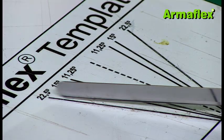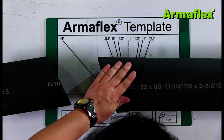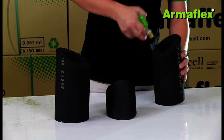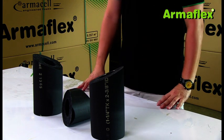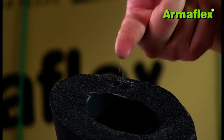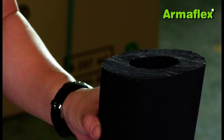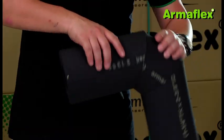For this work, the ArmaFlex tube is cut at a 22.5 degree angle. Both three-piece and four-piece elbows should be assembled in the same way, using ArmaFlex adhesive. The adhesive should be applied to both edges of the joint, and the pieces should be left until the adhesive is tack-dry. The adhesive's initial drying time may be determined by the fingernail test: touch the surface with a fingernail. If the fingernail does not adhere to the surface and the surface itself does not feel tacky, the joint may be closed. The parts will then be positioned together and the joints firmly pressed together, ensuring there are no gaps.